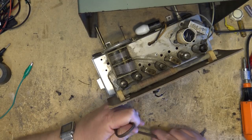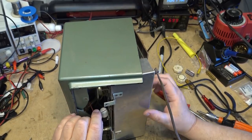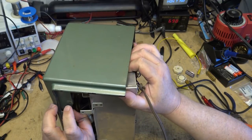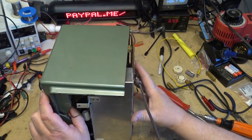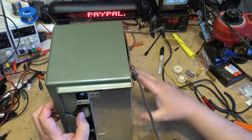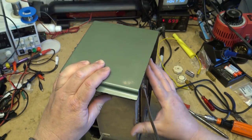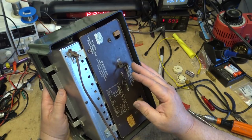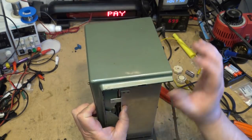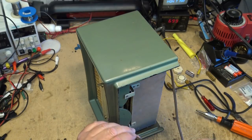See, the power supply on this is rated 117 volts AC or DC. Trick on these is you have to get the dial pointer up in front of the scale. That's why there's a cutout on the bottom here so that you can get the dial pointer in there. Oops. I don't think I'm quite in the right track. Maybe I am. Yeah, I'm in the right track. Okay. There we go. My pointer is in place. Dial string, as you say. Dial pointer.